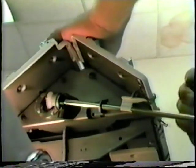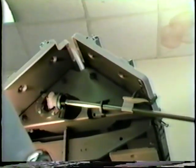Insert the racking handle with the handle pin into the supports at the left under the beds. Make sure that the white cam rests between the two metal ends of the racking indicator.